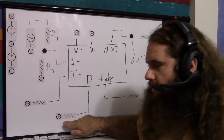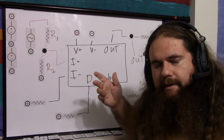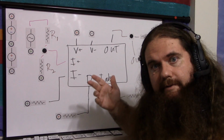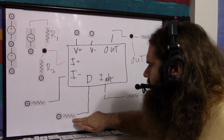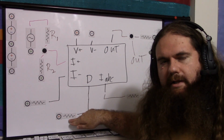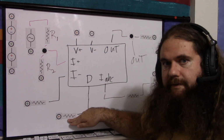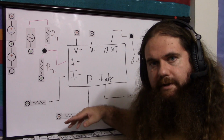It never changes, so just figure out what it should be. Half of the maximum rating, half of the absolute maximum rating is probably good. So you just attach your voltage, figure out a resistance, and throw it in there. And I like to use my multimeter in current measuring mode and a trim pot to figure that out, and then you can stick in a fixed resistor later.